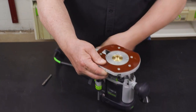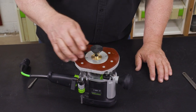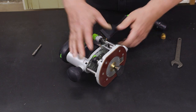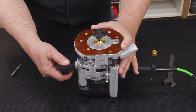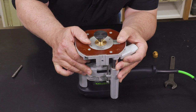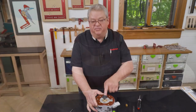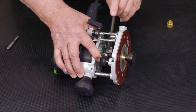There are lots of different methods to center the bushing. What I have for my router is a centering cone. That's going to go into the collet, and then we're going to lift the base of the router up until it hits that cone and that'll push it into the center. I need to lock it into the collet first. Now my centering cone is in the collet — that's what we want to center to. I'm going to unlock the base so that it moves, bring it up, and it will push the template holder into the exact center. We'll bounce it a couple of times to make sure it locates just where we want it, then tighten the screws down. Anytime you're using a guide bushing, you're going to be better off if you have it perfectly centered. Now I'm going to take the centering cone out and put the router bit in.